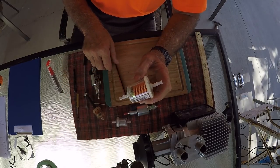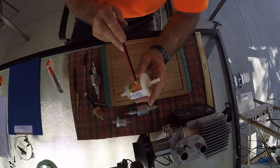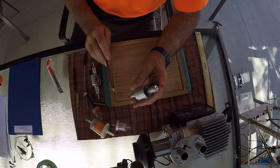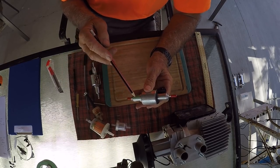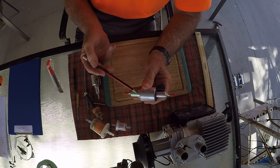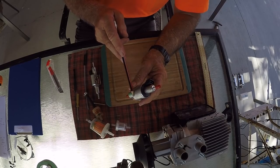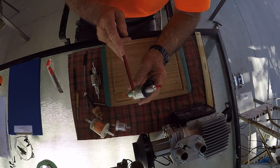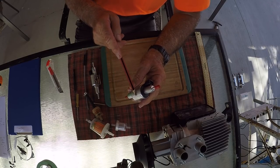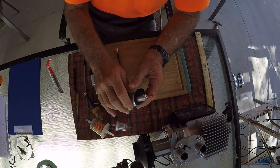If you use one of these larger ones, then you're looking at probably 11 to 15,000 times for this little piston to go up and down, up and down. Now, as I said before, the lubrication is from the diesel. You don't have a separate lubrication like you do on a motor car. Now, how do you think this little piston is going to feel going up and down probably 3 to 5,000 times for a normal filter, maybe up to 15,000 times for a larger filter?